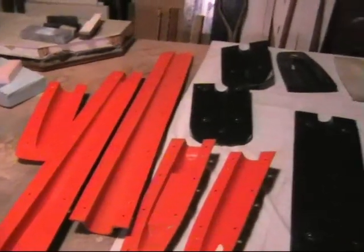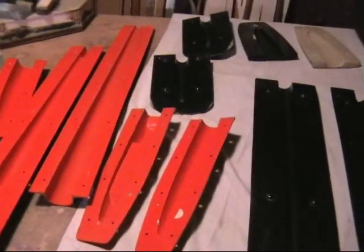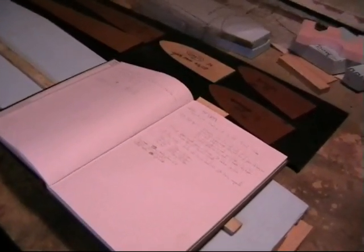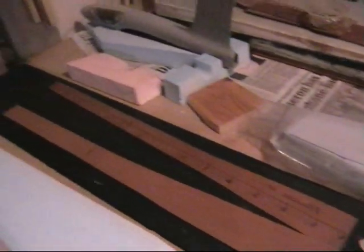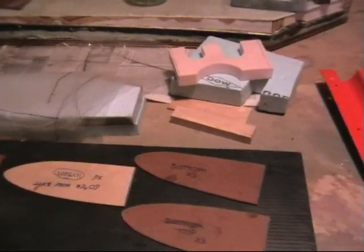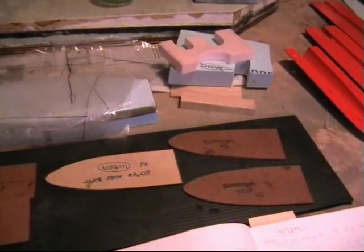I haven't had these moulds out for quite a while, so I'm going to put two coats of wax on them and then some PVA. They're going to be bare fibreglass moulds then, good enough quality for painting the mould. Whenever you lay up a fuselage, write down your lay-up in a book, then when you come to do it again, if you're happy with that lay-up you just know exactly what to do. I've got all my templates, so I just cut around the templates using the thickness of fibreglass and the amount of pieces that the book says, lay it all out on this bit of Corex sheeting, and then it'll be ready to go.